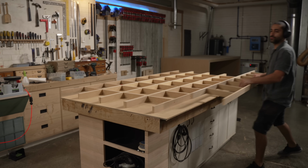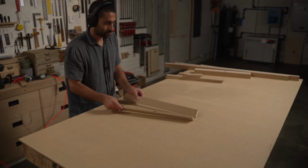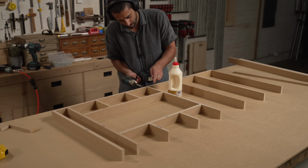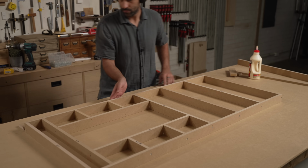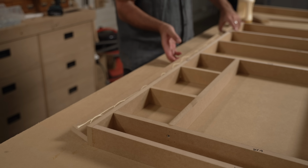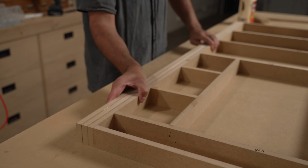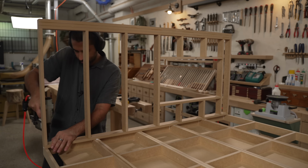Now, there's a number of reasons as to why this didn't work. One is the thickness of the top. Clearly it's 70 millimeters thick over a 2.6 meter span. This isn't enough to support it. So I should have made the grid material thicker, as well as a thicker top and bottom layer. But I do have specific height requirements I'm trying to achieve in this design. So a thicker top would mean a taller bench. I've also made the grid pattern quite large in order to fit my brad nailer and drill. These are all choices I made in order to get the project done quickly. But this is not something that I usually condone.